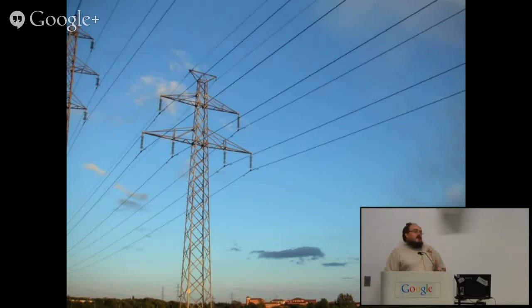Many decades ago, AC-powered wall clocks and mantle clocks and such were very common, where you had an AC synchronous motor that would run at exactly the speed of the grid. In fact, the grids were often controlled with a nice, good old grandfather clock that is considerably more stable, and an electric clock. During periods of light load they would speed up or slow down the grid slightly to even out time and keep people using a wall clock having roughly reasonable time.